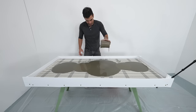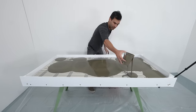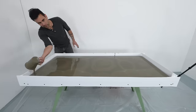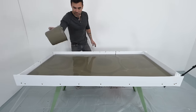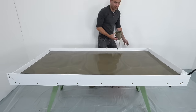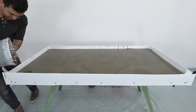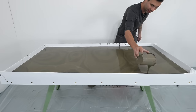And now for the fun part. This floor resurfacing mix is way thinner and doesn't have aggregate like the typical Quickrete 5000 that I use, which means I can scoop it up with a bucket or container and just pour it right on the surface. And because it's thin, it will self-level. The cool design opportunity here is to take the two different tones and make subtle swirly type patterns. The obvious thing to do — which in my opinion is a little overdone — would be some sort of faux marble finish.